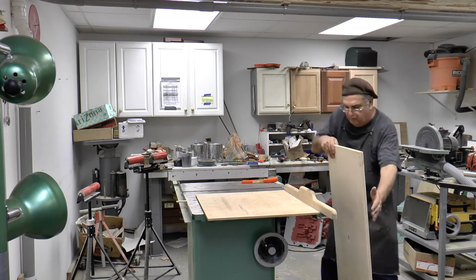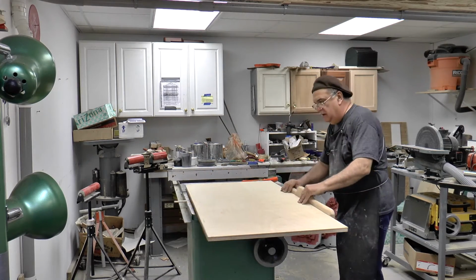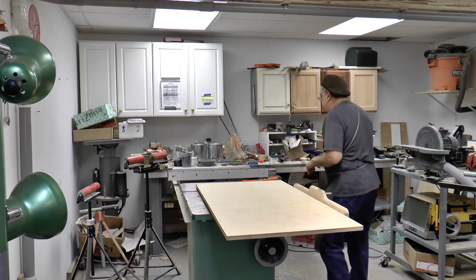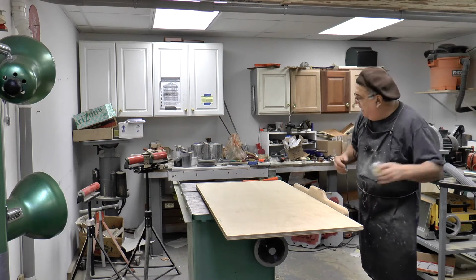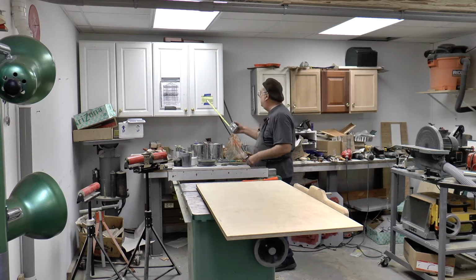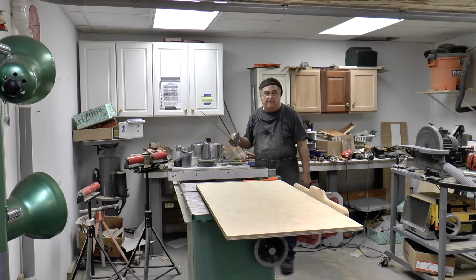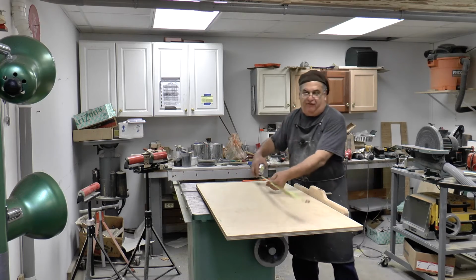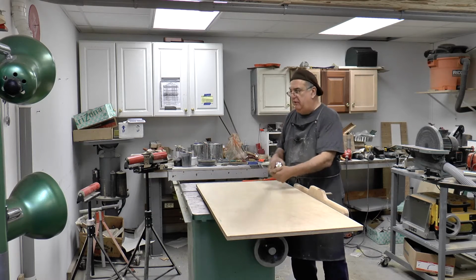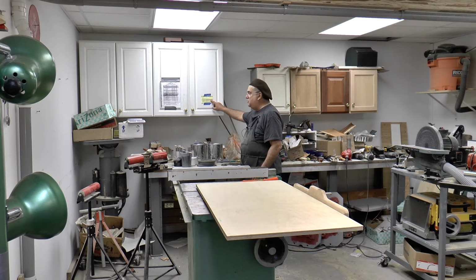So now I'm going to cut this board, and I made this sled, you know. Works pretty good. Now here's the thing with these boards. Let's say we'll do the most common 14-16. That's the inside of the flask. You need a board 16 by 23. So I cut it 16 this way and 23, which is 24. So you can get two boards out of this. However, the 18 flask, the board has to be 16 by 25.